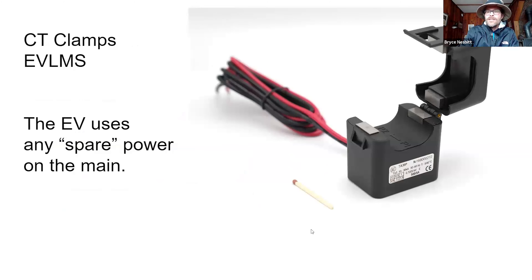Regarding what help an EV owner gets from manufacturers or dealers: some new EVs come with basically a coupon for a local electrician to install an EVSE for you. Most people just hire an electrician. There are two options: get a plug installed and then separately choose your EVSE and plug it in, or have it hardwired. I recommend hardwiring. Hardwiring is required above 50 amps — so if it's a 65-amp charger, it has to be hardwired. Going hardwired also removes the need for a GFCI breaker in some cases, making it cost-neutral. The trade-off is that you need an electrician to change it.